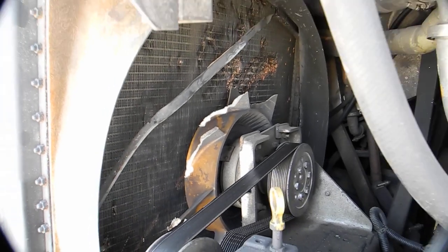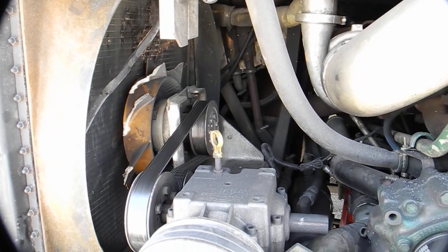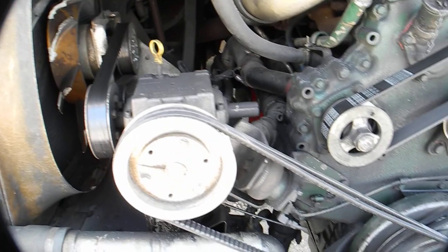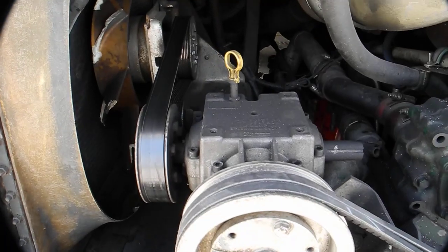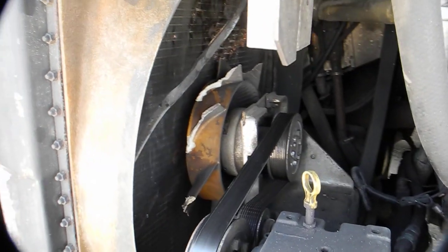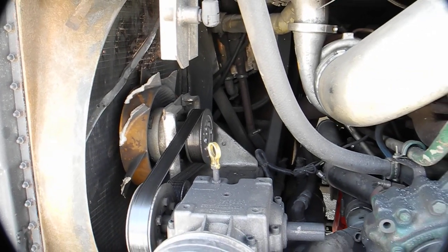So looking at that, and I heard a solenoid, so I don't know if they're going to start the bus, but you can look at this right angle change right here where the belt on the bottom of the engine comes over here, goes into a 90-degree gearbox that then turns that fan belt that turns that fan. So that's the way the air-cooled radiator works on this.